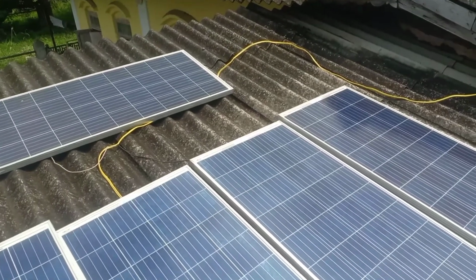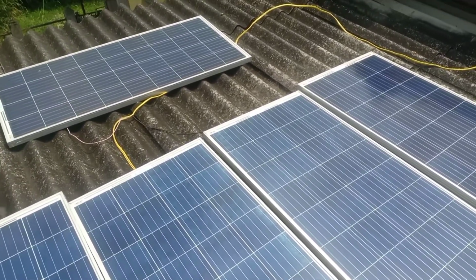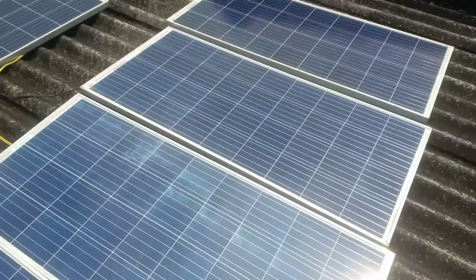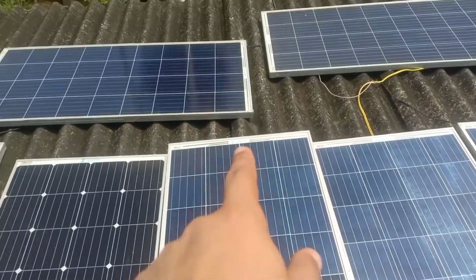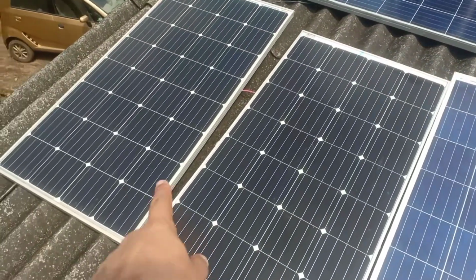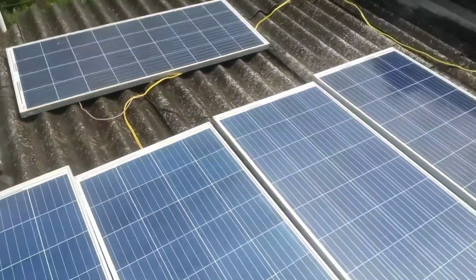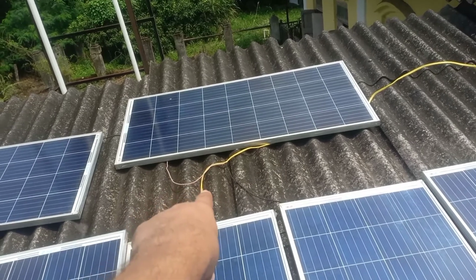Hi, today we are going to demonstrate, not review, the performance of Zunsolar 165 watt panels and the 180 watt mono panels when connected in series. It's mildly sunny. We have 1, 2, 3, 4, 5, 6 of the 165 watt polycrystalline and 2 of the 180 watt monos, all in series. It goes this way, that way. It is connected via 10 square aluminum cable.